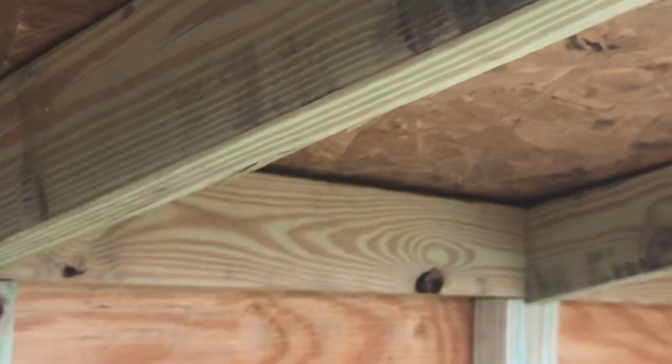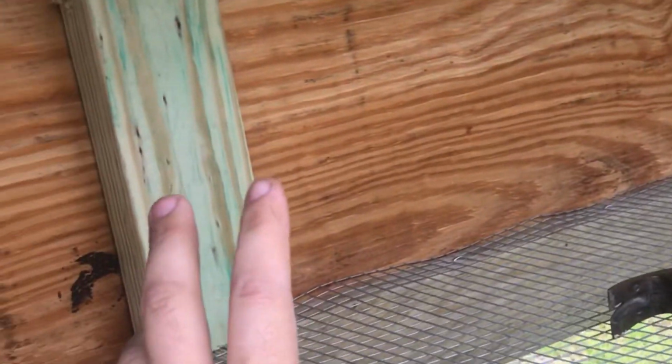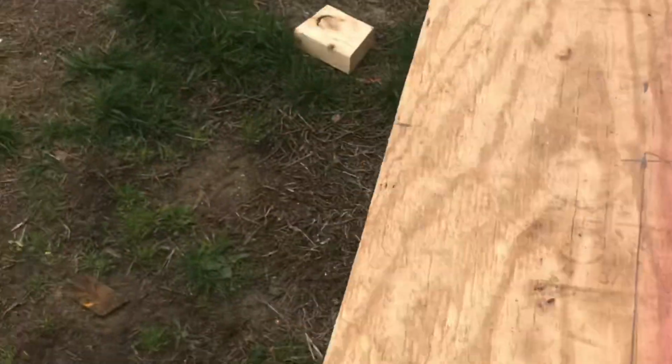You have to make the walls for the cages, the separators. So in the back, to the point right up there, it's 14 inches on the bottom, and then up here, it's 18 inches, like right there to down here, and then we got a 24 inch width. So I already measured it and drew the lines. I'm just gonna cut it now.